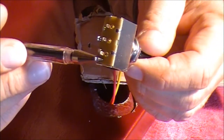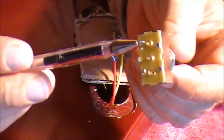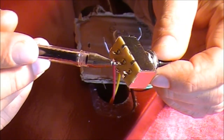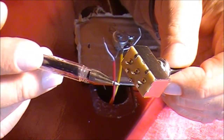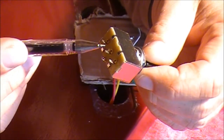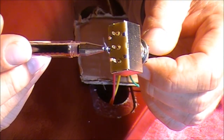It's time to look at the three-way switch. Turn it over and you'll see it's got a few contact points on the back — this one has one, two, three along the middle and then one on the outside. These three in the middle, the two outside ones, are for your pickups — for the hot wires from your pickups. This one here in the middle is your output contact point, so that's going to run from here to the contact point on your tone control. Your tone control and volume pot are already connected, so a contact from your volume pot goes to your output jack and that completes the circuit. This one on the edge is going to solder onto the top of your volume pot — that's just another earth.